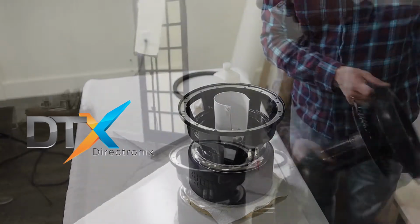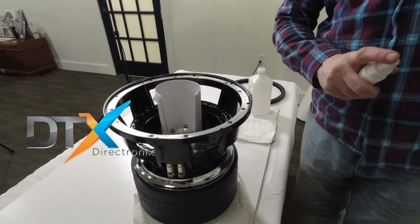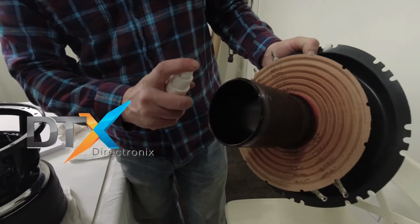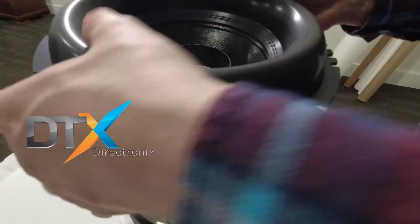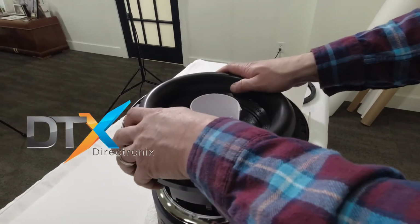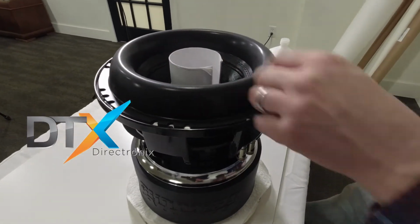What I do is I take the recone, you make sure that the leads are lined up with the terminals on the side. Don't glue this thing down off-centered. I'll take a few, go around twice normally, do a couple squirts. And that accelerator will help it set. Now this is going to be a right now situation, so see it's boom, down. Now, I let it sit there for a second, let the accelerator do its thing.